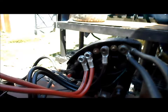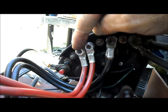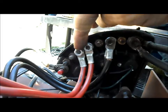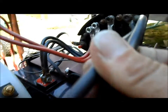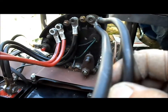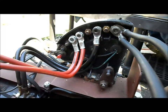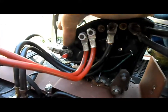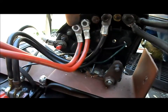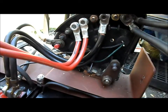What I came to find out as far as the arcing: I ran two cables to each battery — two cables for 12 volts, two cables for 24, and two cables for 36 volts — so they'd keep the cables from getting hot. They're real big cables, not zero gauge, so I thought it would be better. But the way I had it in the drawing, we had one cable going to 12, skip one, a cable going to 24, skip one, then the last two for 36.